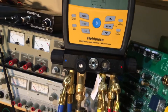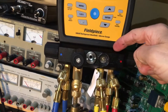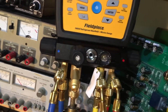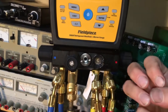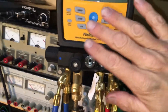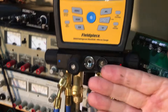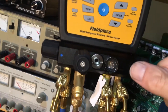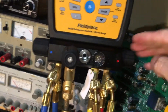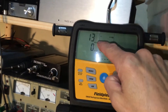Just the vacuum pressure — actually the lack of pressure — is holding this. We live in atmosphere, we're at 14.7 PSI. I'm in San Francisco, almost at sea level, at 14.7 pounds per square inch. This manifold is under vacuum, so basically there's 14.7 pounds of pressure pushing in — not pulling, not sucking. It's the pressure difference that is pushing this in. That little white seal — not Teflon anymore, now made out of a polyester or nylon type material — is pressing under the force of atmospheric pressure pushing.